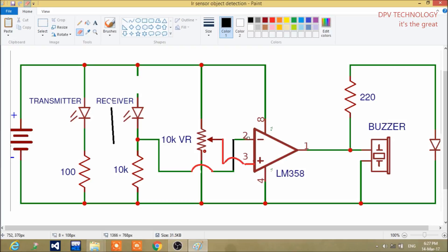The inverting terminal is grounded — zero potential — and the non-inverting terminal is connected to Vcc through the potentiometer. So the potential at the non-inverting terminal is greater than the potential at the inverting terminal, and the op-amp gives an output very close to plus nine volts. This output voltage is applied to the LED and the buzzer, so the buzzer and LED both turn on. A resistance is placed in series with the LED so that it will not burn. So when we place our finger here, the buzzer and LED turn on.